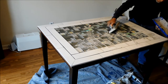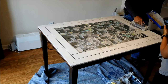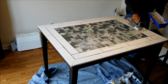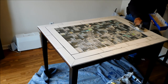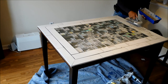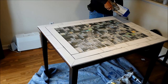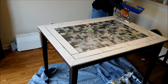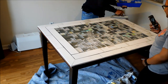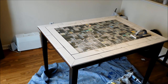After the caulking is all complete and the table has been able to sit for about 30 to 40 minutes, my dad is putting the unsanded grout within the grooves of the tile. If you are using glass tile, please use unsanded grout or the grout will scratch your tile. Our outer pieces are ceramic and the inner pieces are glass tile. We went with a gray grout so that it would match seamlessly with both the ceramic and the glass tile.